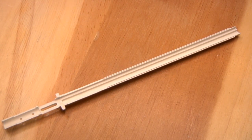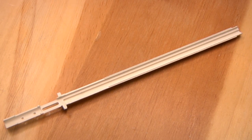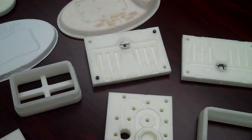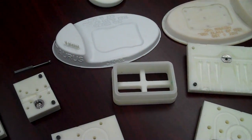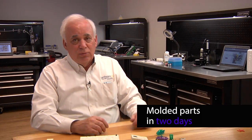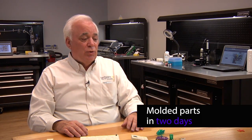In terms of being able to help our customers do more, faster. We moved from just a part like this — it has a thin hole with a core running through it — into things like this, which are much longer with core pins for holes. Then we actually get into insert-molded contacts. We load the inserts, use the printed tooling to locate them, then shoot around them — exactly the same process you'd use in a normal production tool.